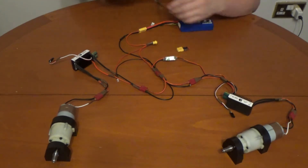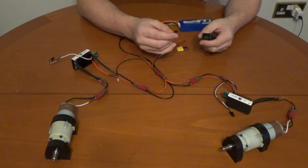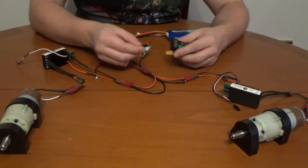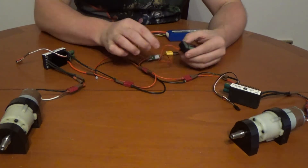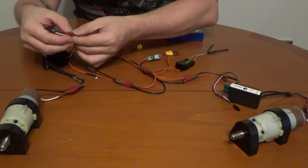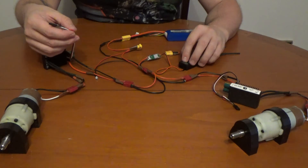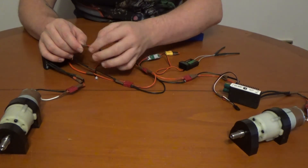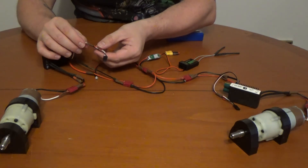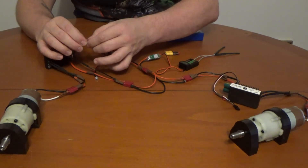The next thing to do is to link up all the small servo cables to the receiver and then let it all run. Receiver here, battery eliminator circuit, the servo — into the battery link. Now, with the servo wires, you need to remove the red wire, because you already have a red wire from the BEC going to the receiver. So take out the red wire, tape it up just so it doesn't connect to anything and cause a short or a fire. That goes into channel 1. The second speed controller servo wire is exactly the same — red wire taken out, because of the red wire already present.